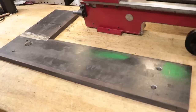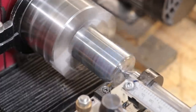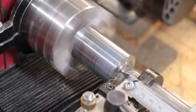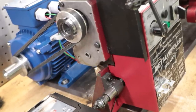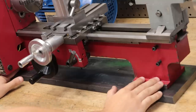I should have been clearer about this in the previous video — the decision to have the two plates welded together was simply to make the whole setup more rigid. Previously I had bolted the motor directly to the workbench, and that simply flexed as I was tightening the belt. The workbench is made of wood — pretty thick wood, but still wood — and you could see the whole motor and lathe moving in some older videos. Doing it this way prevents that, and I can use foam under the motor to dampen vibrations if needed.